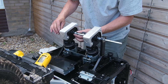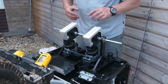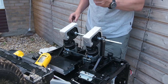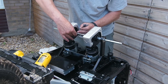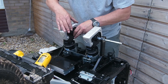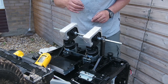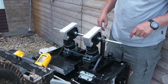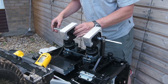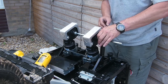Just lovely - so remember, it's the ball bearing that transmits the thrust to the shaft, and that works beautifully. Now we get our grub screw - the grub screw only sits in the collar; the grub screw's job is to keep the ball bearing in place. Let's screw that back in. I'll do that up with the hex key in a moment. Just making sure that it is tight, because you've got to get these things so there's no movement.